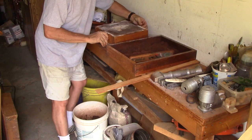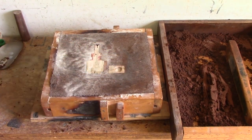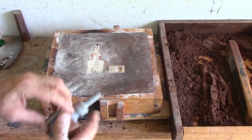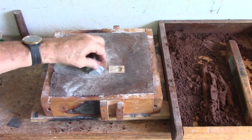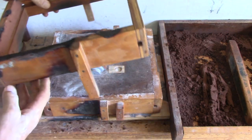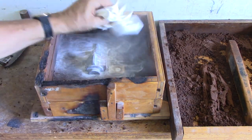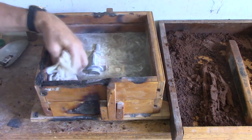Here we go — as a flip. See the pattern in there? You take the other half of the pattern and just plop it right down. Then the other half of the mold box, the cope, fits in these slots. Dust this whole half of the pattern with parting dust and the top that you just filled with sand — you don't want these two to stick together.